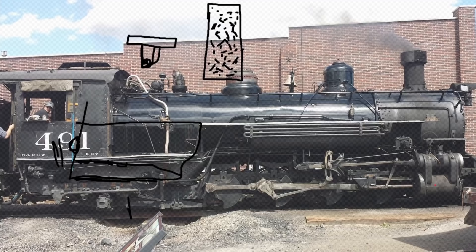That is mostly how most coal-burning fireboxes are set up. In the case of 491, there's no dampering control — no way to change the airflow in. Some British locomotives had dampers to control airflow from the bottom, and a lot of wood-burning locomotives also had that. I'll admit I don't know much about wood-burning firebox setups other than they're usually a little deeper to have more wood in — so if you have experience with a wood burner, I'd love to hear more about it.